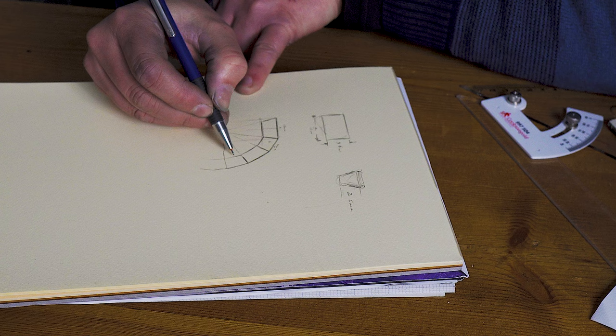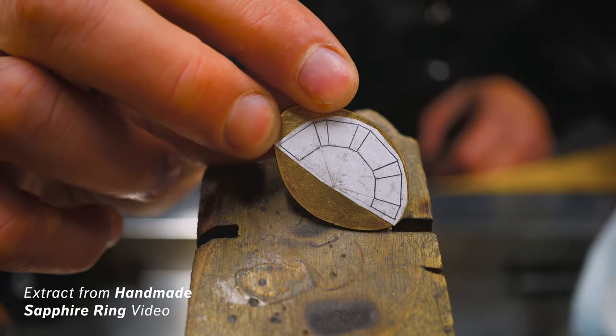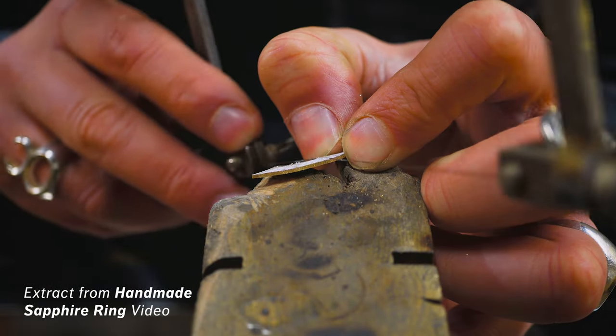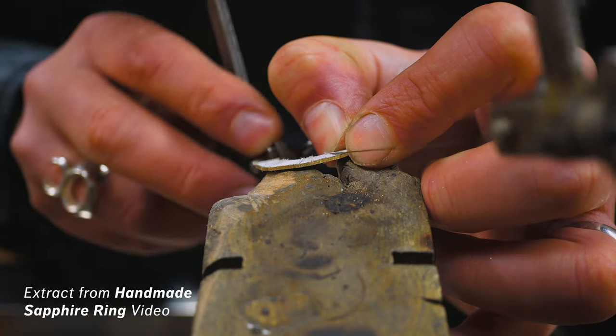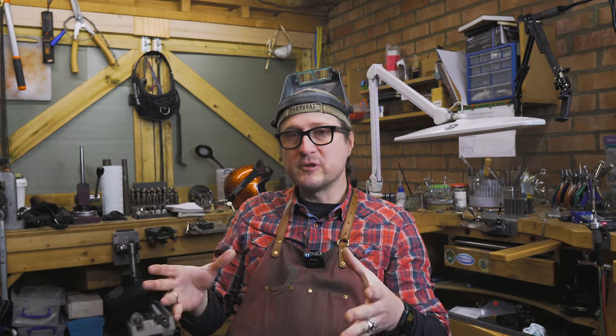Once done, you cut the piece of paper out. This is why it's so important to work with a fine pencil — maybe a 0.5mm pencil — making sure it's nice and crisp, because you have to cut exactly on these lines or just past them to preserve them. Spend the time to make it as neat as possible. You cut through the lines which divide the sides, but not all the way through — just as a reference score. In a square or rectangular setting you can use a square file and cut about three-quarters through the flat plate, then fold to create a 90-degree corner. I prefer to take a saw blade, doing it very cautiously, sticking exactly on that line. If your angle is incorrect, by the time you fold this the two parts won't match, so stick with the angle you've drawn. Technical drawing should be as accurate as possible — take your time with this step.